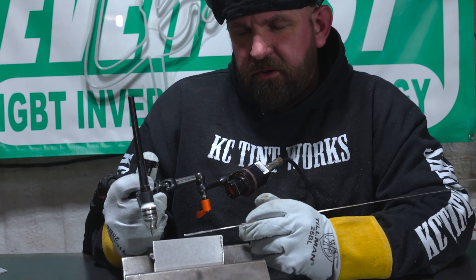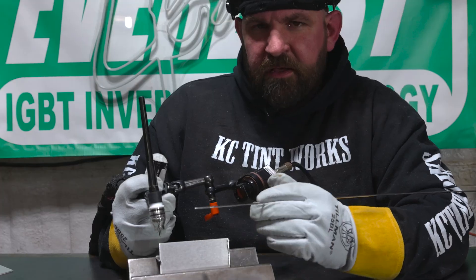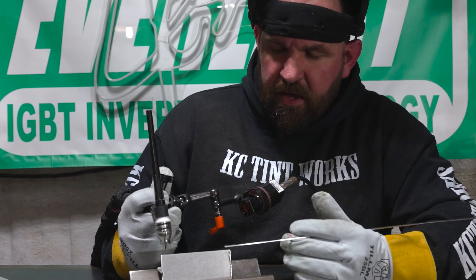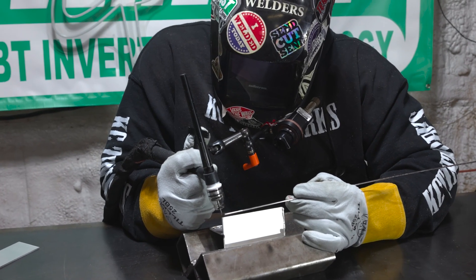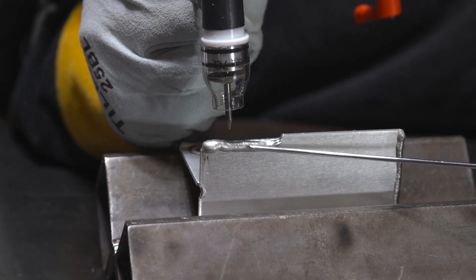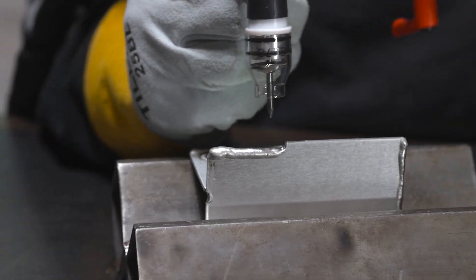We're going to do a couple bad runs. The first one demonstrates the main mistake I see beginners make: they'll flat-foot hard into it and lose control with the foot pedal — their foot's all over, up and down. You can see on this run the height of our weld bead is a lot lower than when we started. Running way too much amperage, I long-arced it to show you how it just starts melting the material away. As you go up in torch height, that ups your voltage and really starts melting the material away quickly.